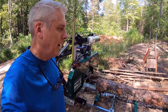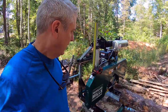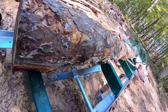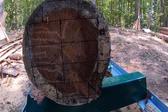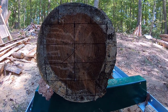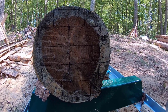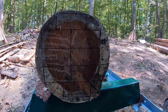I'm back at it, cutting pine 2x4s for framing, and I've got another pine log on here. I've tried marking it up — hopefully you can see that. I've got marked out six 2x4s in the center, and then one on the top and hopefully one on the bottom. The top and bottom ones probably won't really work out because the other end is narrower and there's a dip in the middle. That top one's not going to work at all, but at least I'll get the six out of the middle.